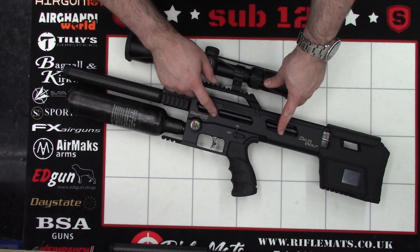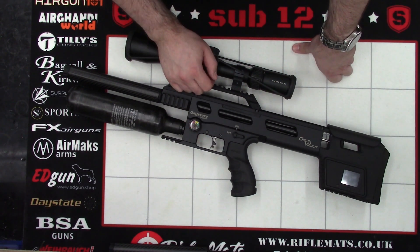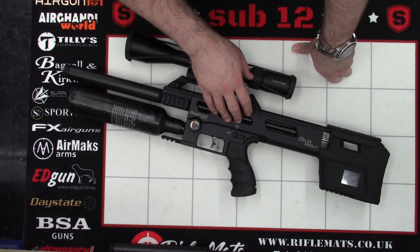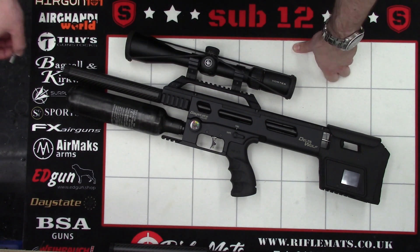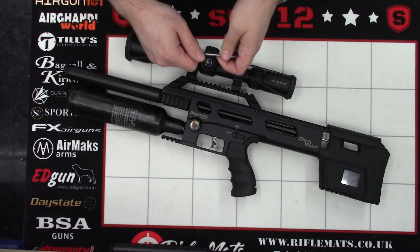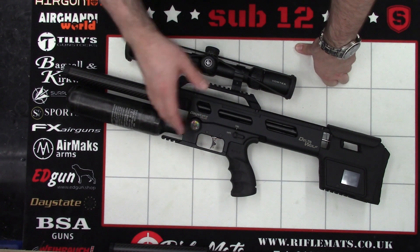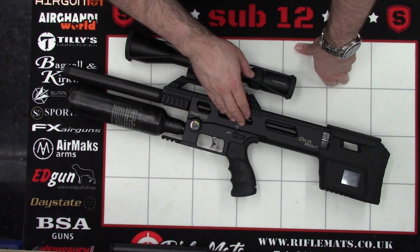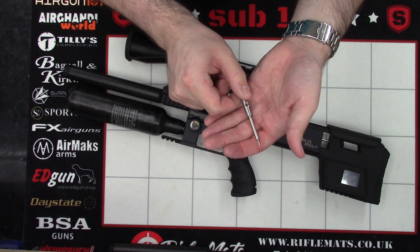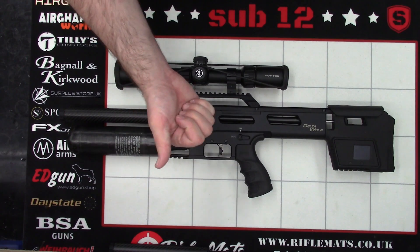Firstly, what we're going to be doing is reducing the plenum size. The actual plenum on the Delta Wolf is quite large — it's about this long and is a fairly large diameter, so there's a lot of volume in there. In our experiments for sub-12 rifles, that's not always the best thing to have, so what we're going to be doing is just making some Delrin plugs, sticking them in there, and seeing what happens. The other thing we're going to be experimenting with is a pin probe — this is a .177 pin probe that I've made up — and we're just going to experiment around with that and see what happens when we put it in. The pellets that we like to use don't work tremendously well in the magazine; specifically JSB Shorts doesn't cycle perfectly — some positions in the magazine it's a bit notchy. Hopefully a pin probe will sort that out, as the probe will push the pellet from the centre rather than the actual edges of the skirt. But that's just another thing we're going to be experimenting with in the future with the Delta Wolf. Thanks for watching, and I'll see you in the next one.